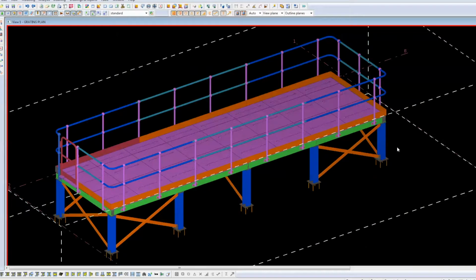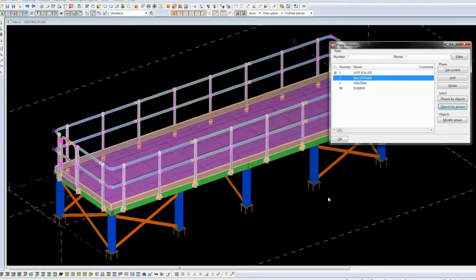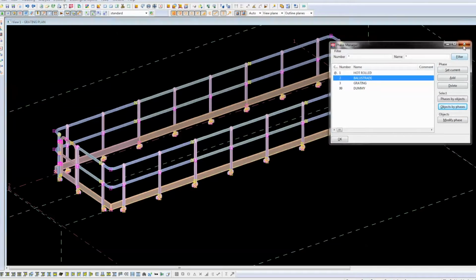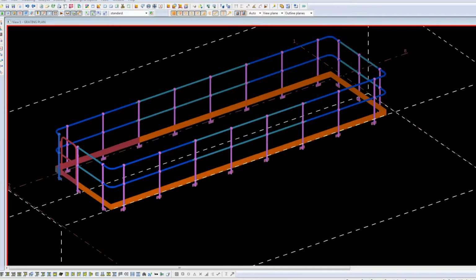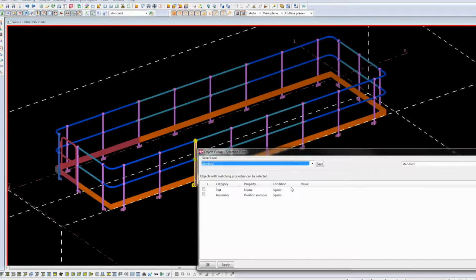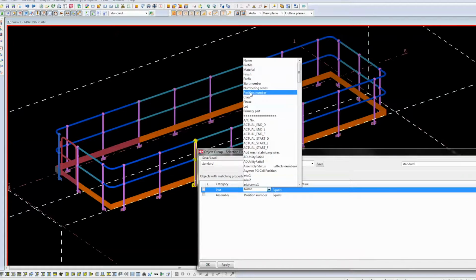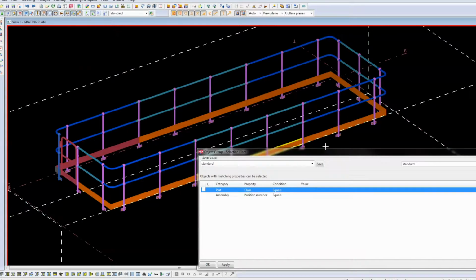And we'll do the same with balustrade, get that one done as well, that's the easiest one. Select each balustrade, objects, properties, and show only selected. Kick flats, we've got these orange kick flats. If you want to do it by class, obviously you class or name, just set up your filter: part name, part class equals, select from model, class 13, apply.